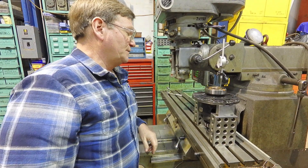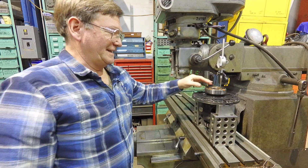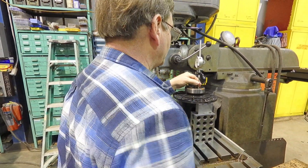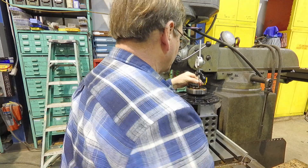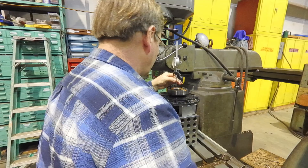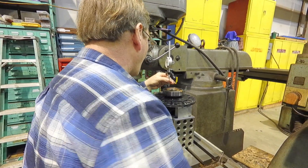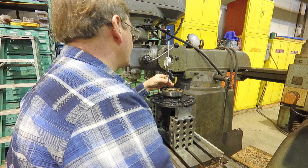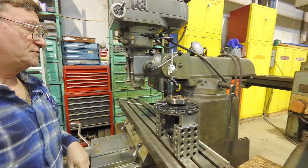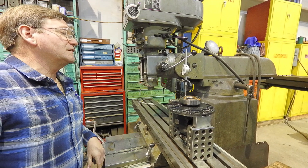What we're doing here is we're measuring where this bearing is, just setting a zero, not really measuring it directly. I check it at one side. The other side is also sitting at zero, so that's good. It means that it's sitting straight on the bearing there.